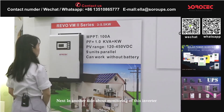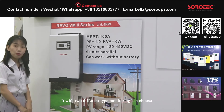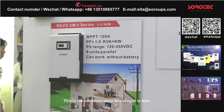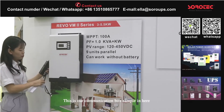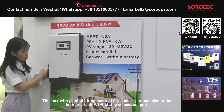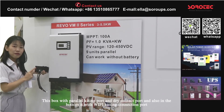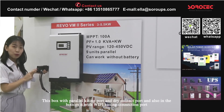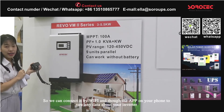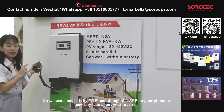You can also carry 6 kW and 9 kW since its minimum power is 3 kW. Now, on another side, regarding monitoring of this inverter — this inverter supports two different monitoring types. The first is monitoring by Wi-Fi. As you can see here, this is our communication box assembled here, with the power connecting port, dry contact port, and also at the bottom the Wi-Fi connection port.